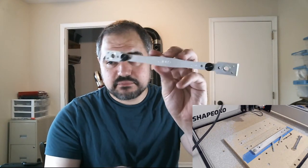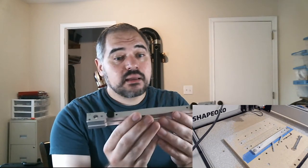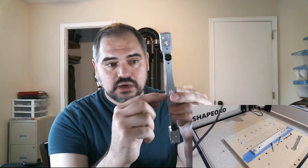And now we have a mostly complete alto crumhorn shaper. So the few things I'm not going to do on this stream, but afterwards: you might notice that there's no V-groove on the edges. Normally you like to have a V-groove on the edge of the shaper. That way you can cut a notch that gives you a fold point.